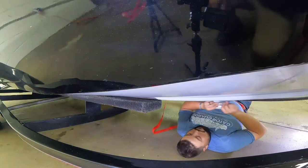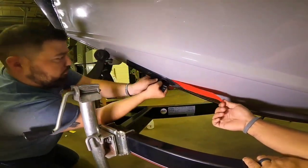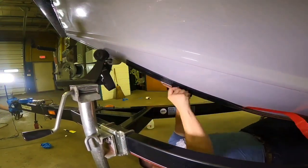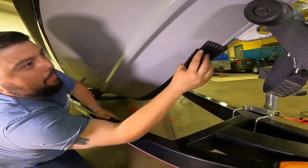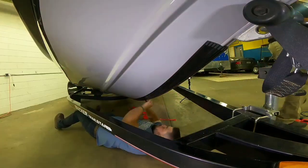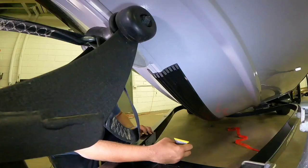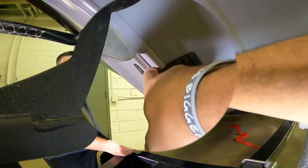This is the most important step. If this is done correctly, you more or less have a lifelong product for the life of your boat. Once you've got all sections run down and it's all pressed against the hull, go ahead and give it a lateral squeegee on both sides. Do this fairly copiously to make sure there's a nice even squeeze on the 3M product. Because this keel is not a straight triangle and there's a little divot, we're going to have to fill the top with sealant.